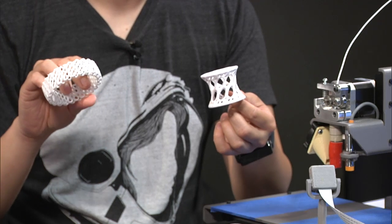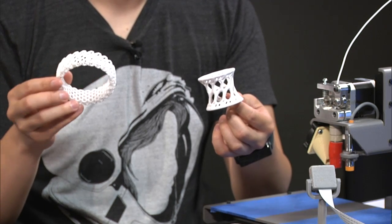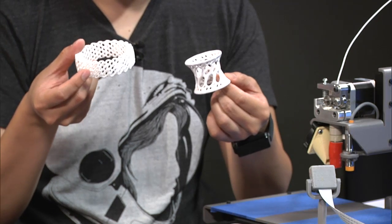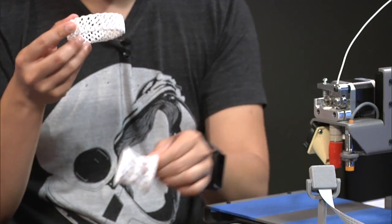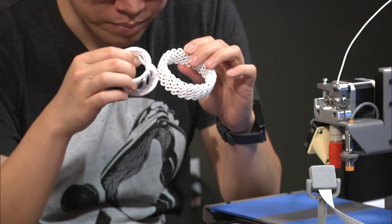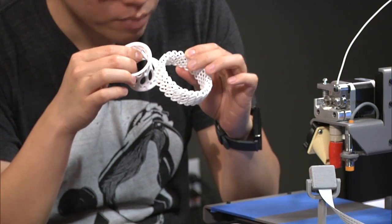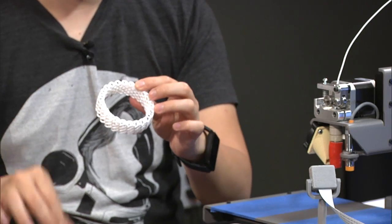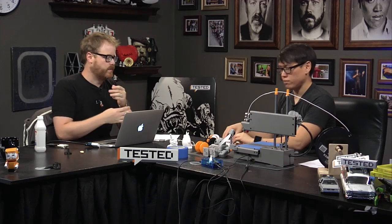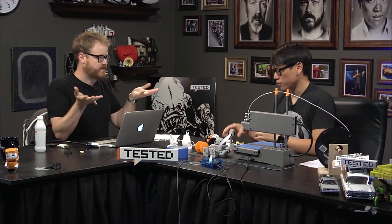The 0.2 millimeter profile that I'm using for the Printrbot, because they're using a relatively slow motor speed for the printhead movement, actually gives really good results that I think are pretty comparable to the 0.2 millimeter resolution on the Replicator 1 using Makerware. It's a little bit of an apples to oranges comparison because we're using different software, a different printer. Everything's different. But at the end, you can compare the two things that are printed and see.